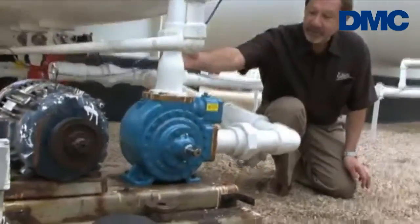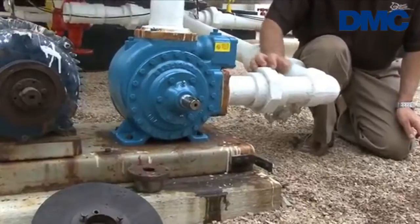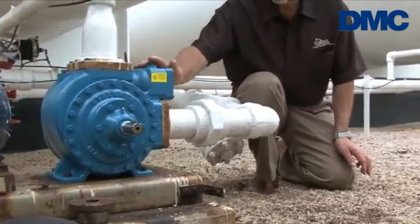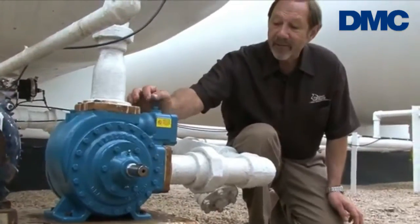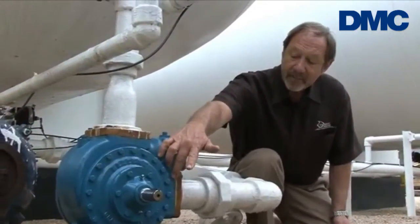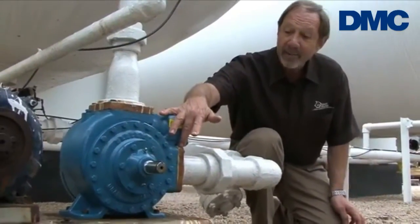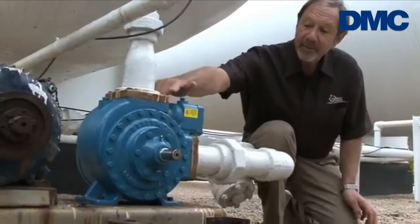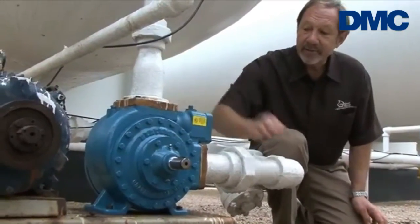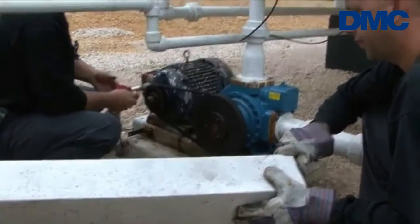Had we needed to change the piping, we would have had to break the unions, pull the piping out, break the flange out, and cut the welded piping. Using the Blackmer LGL 3021 series, the inlet flange assembly of the pump lines up with the flange already in the piping, and the outlet flange of the pump lines up with this flange. Slide it in place, replace the bolts, and she's tied in and ready to go. Tighten her up and she's leak proof.